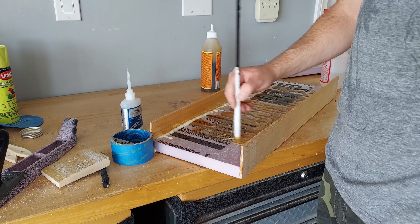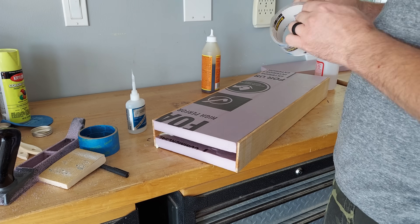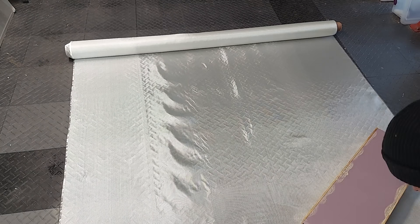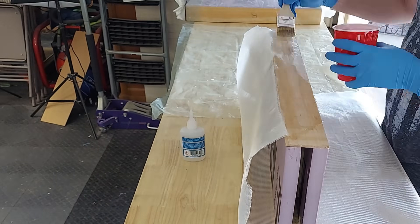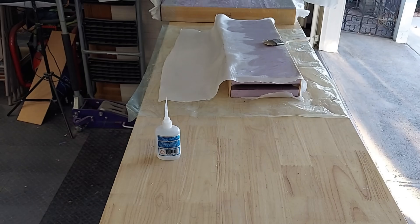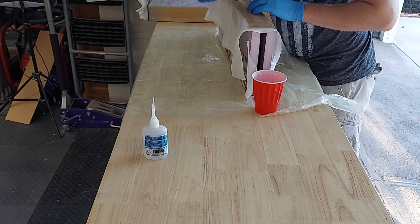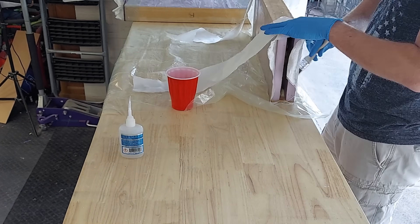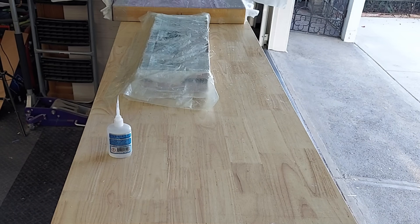A joiner box for each wing is necessary to carry the loads from the wing into the fuselage. Using the same size spruce caps as the wings, I glued them in place with foam supports and then wrapped them with bias-cut fiberglass. Finally, I wrapped the ends of the box with straight fiberglass and did a poor man's vacuum bagging job — just release film wrapped in packing tape.